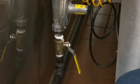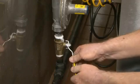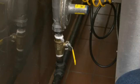Installing a Safety Link is fairly simple, but keep in mind that the dangers of working with gas should guide you carefully through the process. First, make sure the manual gas shutoff valve is turned to off. If you can't find a shutoff valve, turn off the main gas supply line valve. Never proceed unless you are sure the gas is turned off.